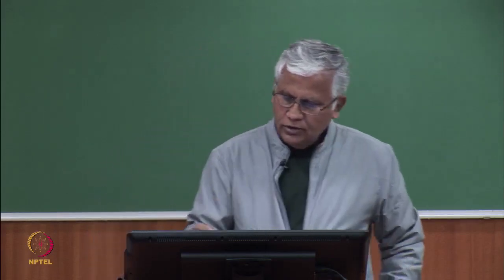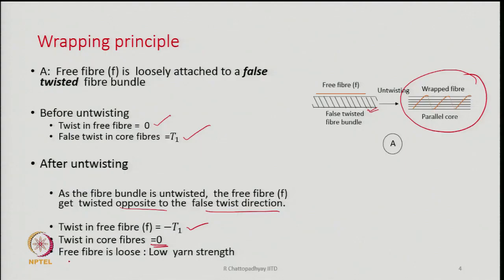Unfortunately, if we follow this, the free fibers will be very, very loose, because both ends of the free fiber will be at this end and this end. Suppose this is 1 and this is 2. Both the ends are actually staying on the surface of the yarn, and therefore, this will basically be a kind of loose wrap. There will be hardly any tension